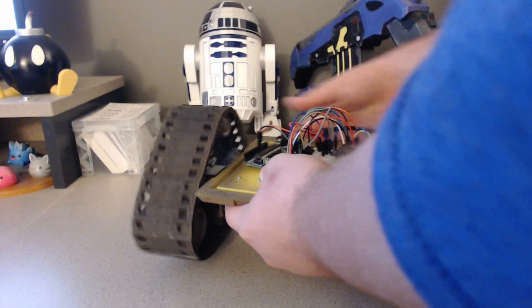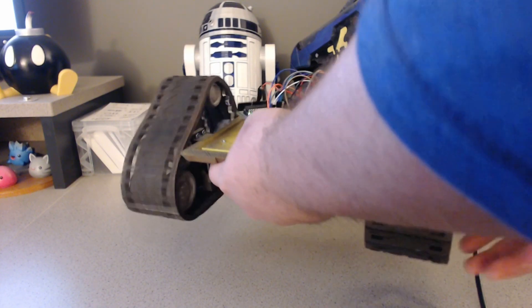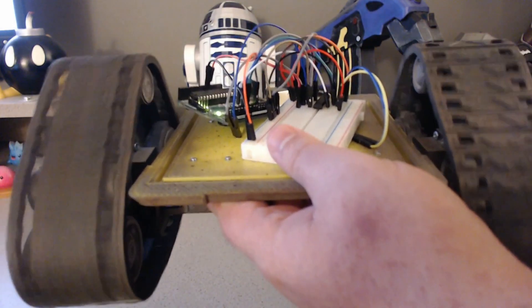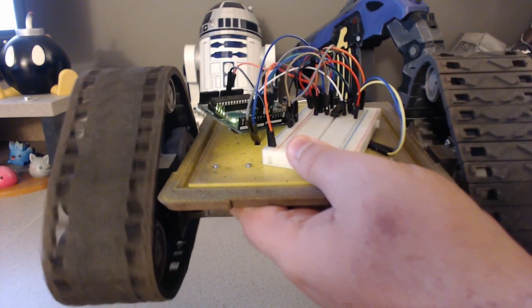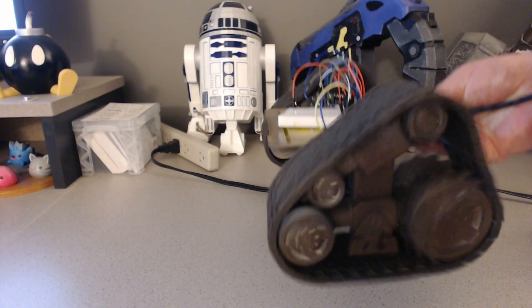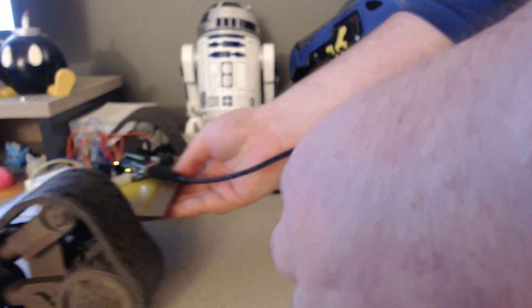So what about the movement — did I get that working? Yes and no. Technically everything works, but not good enough. The biggest issue is that the motors I chose to drive him just don't have enough torque to get the job done. When they aren't under any load, the motors can actually turn the treads. And the treads are actually one thing I'm pretty proud of — they are interconnected with tiny little pins that hold them together and allow them to move, and they work perfectly. But as soon as I set WALL-E's base down, the friction from the mechanics and the printed parts rubbing together causes the motors to stall out.